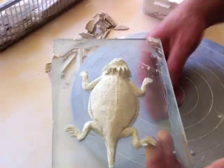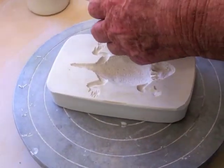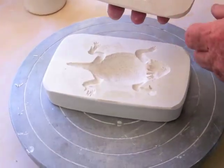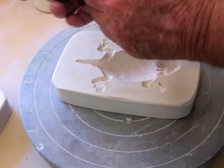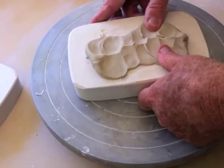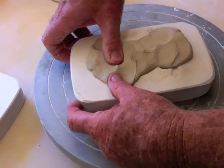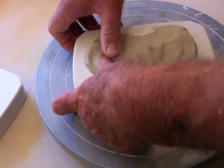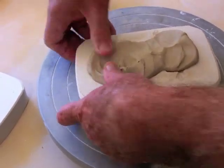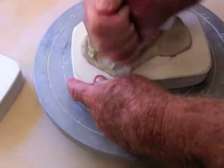So I'm going to save this. I have both sides of the molds right now and they're cleaned up so there are no undercuts. Then I take clay which is smooth on one side and press it into the mold. Now where the horns were, or the crown around the horned toe, I want to really press in there hard and push it all the way down.